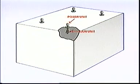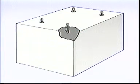A unit consists of the gun unit and the power unit. At the lower end, there is a revolving nozzle which can be directed at most surfaces within the tank. The movement, a horizontal rotation and slow elevation change, makes the single jet of water or oil move in a helical pattern. The movement is governed by a turbine driven by the liquid used for washing.